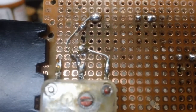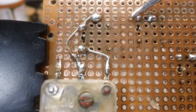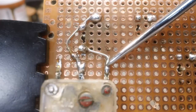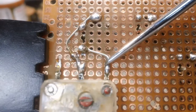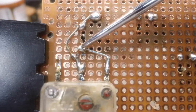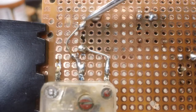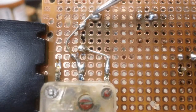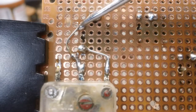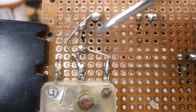I'm back with you again. It's 2:51 now in the afternoon. What I have here is the coil connection for the capacitor going over to the one that it's supposed to go to. And the other end is the ground, and that goes to the ground lug of the case of the coil, and also comes over here to the middle lug of the capacitor, which is also ground.